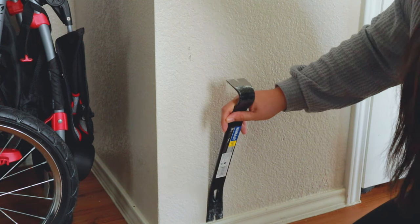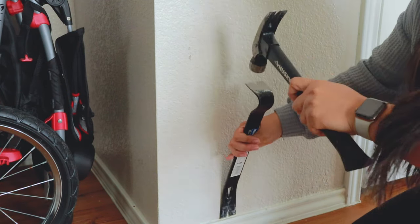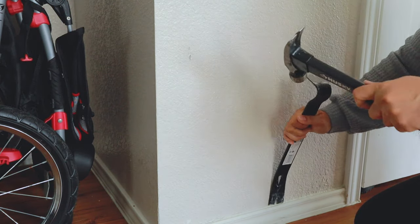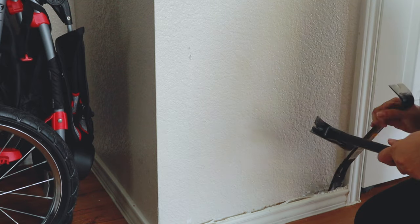Now that I've lightly passed my knife to remove the silicone away from the wall and baseboard, I'm going to use the pry bar and hammer together to separate the baseboard from the wall. You want to put the pry bar as flat as you can with the bottom part towards the wall, then hit it with the hammer. I finally removed the bottom piece — that's how you remove your baseboard with those three tools. That was step number one.